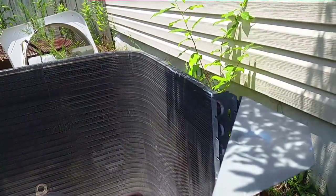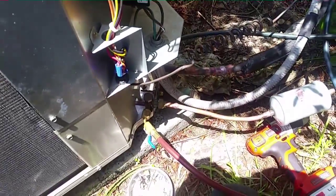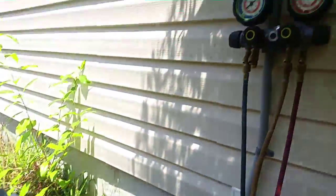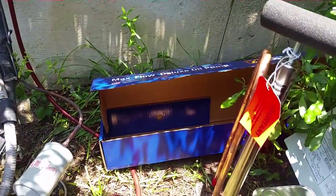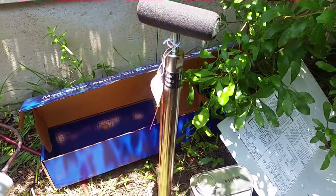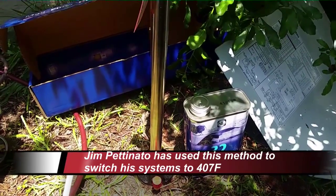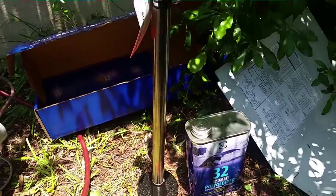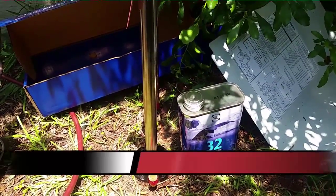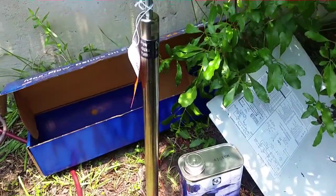About to get the pump and put the oil in right before the compressor, then pull a vacuum and add our R-407C. This is my new Yellow Jacket Max Flow Deluxe oil pump with some ester oil. All I need is a couple strokes — it's 3.8 ounces per stroke on this pump, so a couple strokes will give me around seven or eight ounces. Following guidelines Jim used in his videos — about 10 to 15 percent POE. The total oil charge of the compressor is around 25 ounces, so that puts me around 20 to 25 percent of the total oil charge in POE.